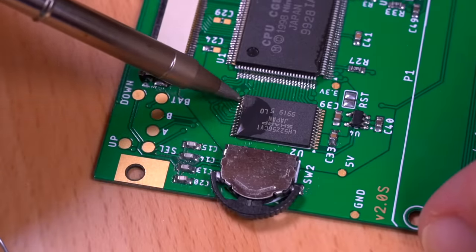Now let's start prepping the IPS kit. Because BucketMouse integrated all of its controls into the motherboard, we can remove the touch sensors. Then we can proceed to solder in all the necessary wires for controlling the IPS kit. We don't need to solder in a wire for ground. Once that's done, we can drop in the IPS panel. And then drop in all of our buttons and membranes. Followed lastly by the motherboard.